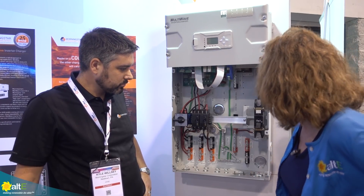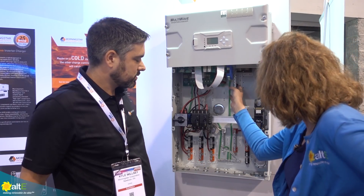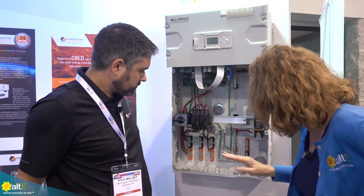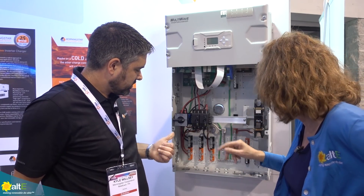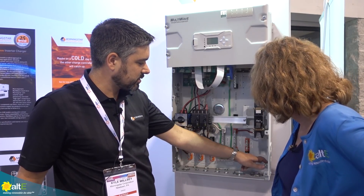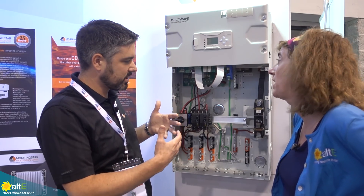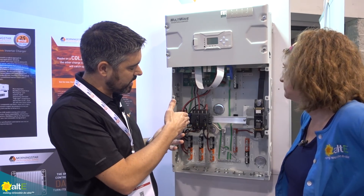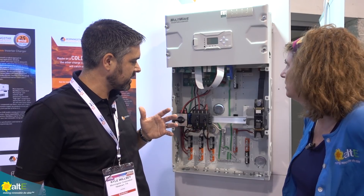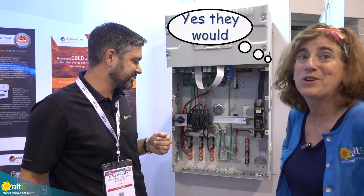I'm even seeing that you can go through the wall in the back — this makes for a nice, easy installation. You've got the bus bars for the PV, for your AC, everything clearly marked including gen sets. Some of the wiring and labeling will change on the production model. We anticipated that sometimes the battery is placed behind the wall in a separate battery room and you want to route the wiring directly through; sometimes it's below, so we have the knockouts there. The goal was to accommodate anything we might encounter in the field.